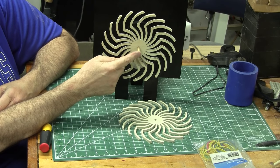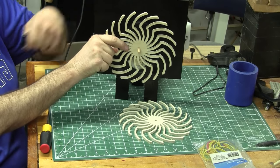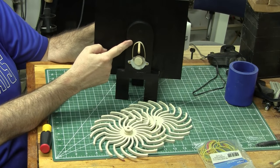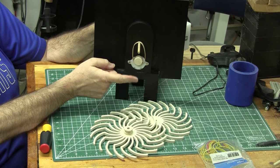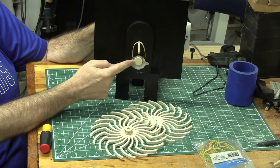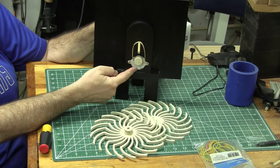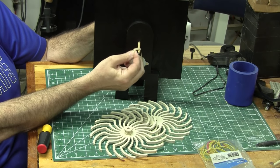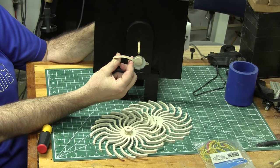The shaft does not move — this shaft is actually glued into this back panel right here. The motor down here with this sprocket, which is identical to the sprocket on the back of this piece — these are the same. This sprocket turns off of this motor right here, and I've got a little quarter-of-an-inch rubber band, and that is what I'm using as a drive belt.